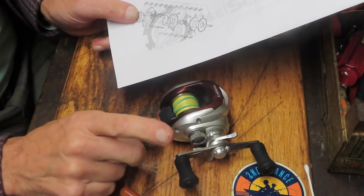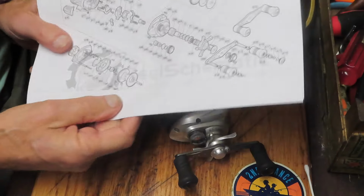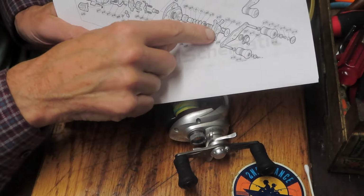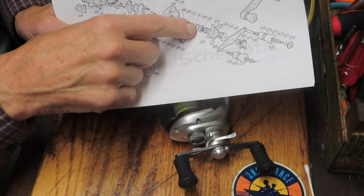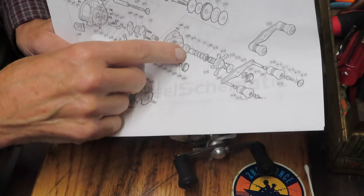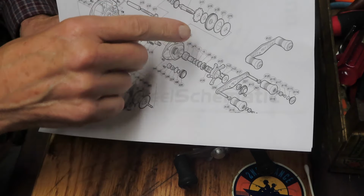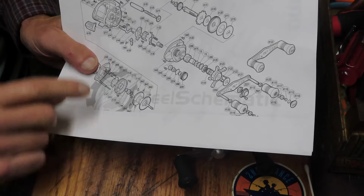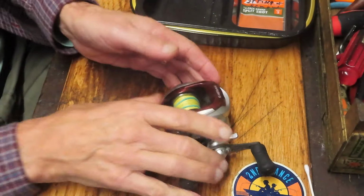So we said it's localized to the gear side. And when we worked on the gear side, we found a couple of things. The spring was not installed here. That washer was upside down. This nut was upside down for the spring. We're not quite sure whether the studs were in the main gear or not. We came over to the anti-reverse assembly and found out that the anti-reverse dog was not installed correctly either. Let's see how we did.